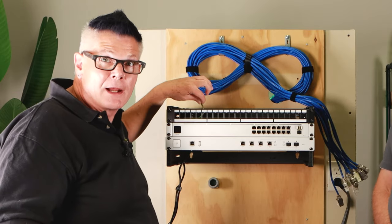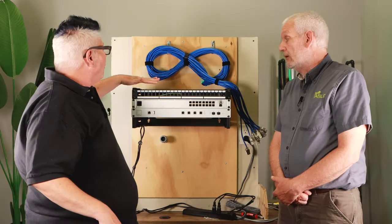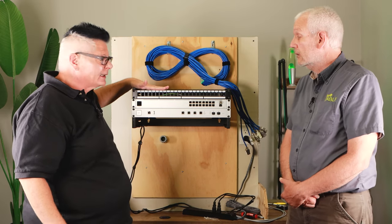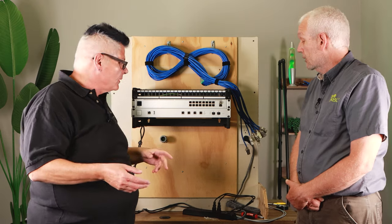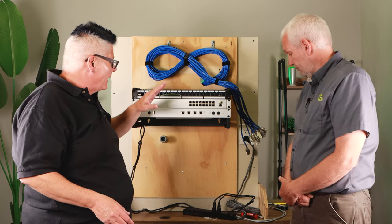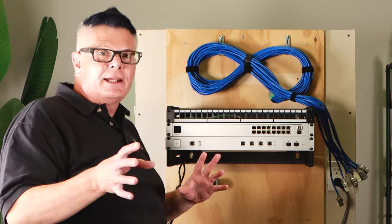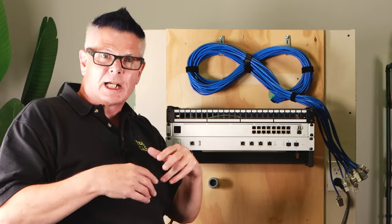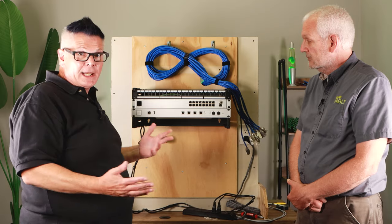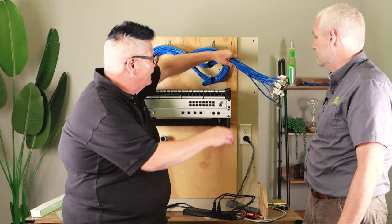When we're talking about putting in cabling, this is a multimedia AV panel — it's not just ethernet keystones. You can put shielded runs in here, unshielded runs, AV keystones like coaxial BNC, HDMI, any of that. The only caveat is no Cat6A unshielded runs that are going to be pushing five gigabit or faster, because of the alien crosstalk issue. Everything else, no problem.